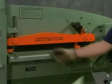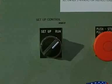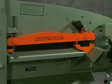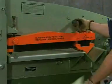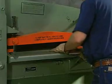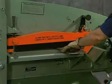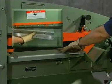This is the flat bar shear station, which can be operated with the joystick or the remote foot control with limit switches. Make sure the punch end setup/run selector switch is in the run position and move the selector switch at the rear control box to the shear station position. Using the rear control box joystick, raise the upper beam to its full up position and loosen the hold down adjusting nut at the far left. Make sure the three-position cam lock is in the proper position for the metal thickness to be sheared. Insert the material under the hold down and through the knives, then tighten the adjusting nut to lower the hold down, stopping just before securing the material. Use the material alignment guide, which is perpendicular to the shear knives, to ensure a square cut.